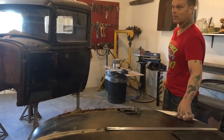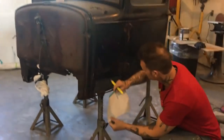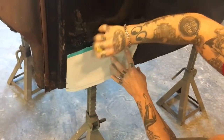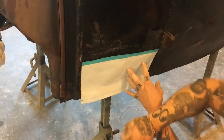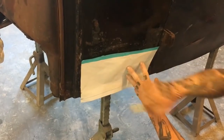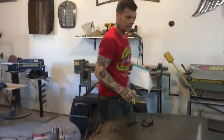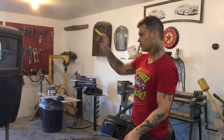This is how I'm going about it — I take a piece of paper, same thing I always do, make a pattern. So I've made a pattern on this thing, put it here, and traced that off. My piece is going to fit in here — there's my body line, from there to there, there to there. And this is my three-quarter inch I'm going to fold under. I'm going to make two of those — I'll make one this way, and on the other side I'll have to flop it over and do the other side, but I still have the pattern.